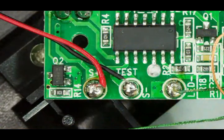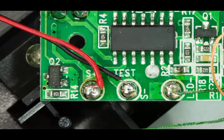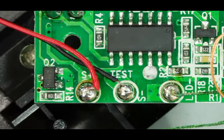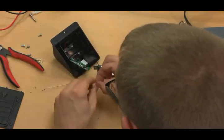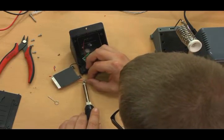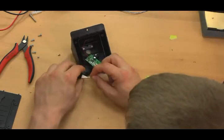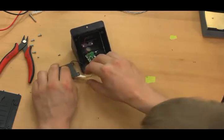One gripe I have about the construction is that the wires from the lithium cell were stripped very poorly, and therefore only had a couple of strands of wire connecting them to the circuit board. The black wire only has two or three strands tacked onto the solder pad out of maybe ten or so. When I went to splice the red wire back together, it just broke free from the board. The solution was simple — I spliced a random piece of blue Cat5 that I had close at hand. It's a temporary repair until the next time I disassemble it. Heat shrink tubing would have been more secure, but a bit of electrical tape is just fine on this very low voltage connection. With that done, I put the whole thing back together and moved on to installing it.